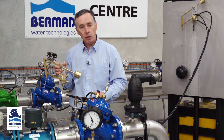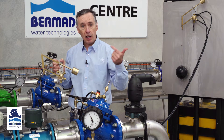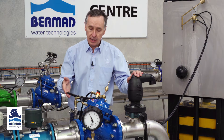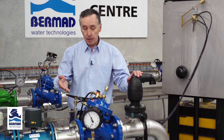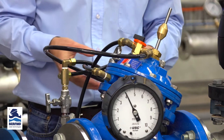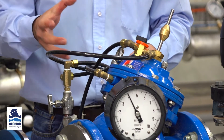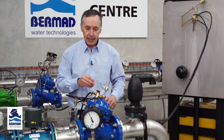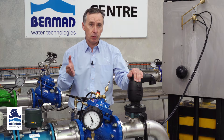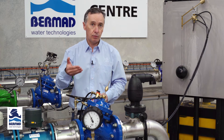The valve is set up to take three-eighths nylon tube or copper tube to run up to the tank. It's important that the control tubes are protected — it doesn't generally matter how far the tank or float is from the valve, but the three control tubes running to the valve should be protected by putting them inside a conduit or another piece of pipe. If the float is outside the tank in a frost-prone region, make sure the tubes are covered, as frozen control tubes will prevent the valve from operating as designed.